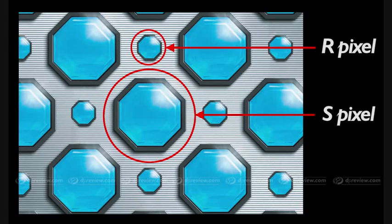Then they updated that by pulling that little photodiode out and giving it its own micro lens on top. Again, this is real geeky stuff, so you probably don't need to know about it, but some of you might find it interesting. So that's where, for example, the Fuji S5 Pro, which is renowned for having a huge dynamic range, much more than what other cameras can get, it's because they effectively had two types of photodiodes on the one thing. So one, a small one and a big one.